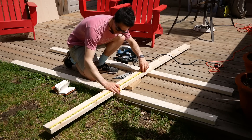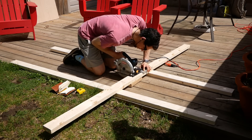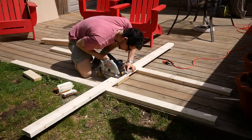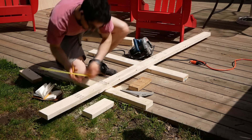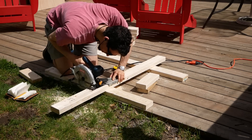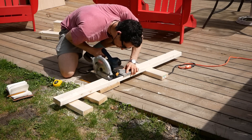The frame of the enclosure is a really simple design made entirely from 2x4s. I used the same basic frame construction as Bob of I Like to Make Stuff, who built a much bigger enclosure and workstation with room for his multiple 3D printers. I got my cut list from the Fusion 360 model and used my circular saw against a speed square to cut all the 2x4s to length. This project uses four 8-foot 2x4s in total.